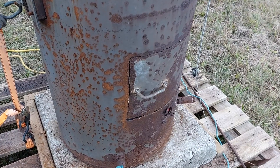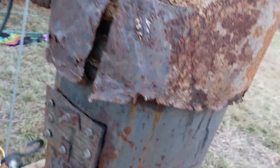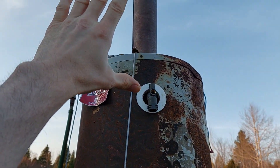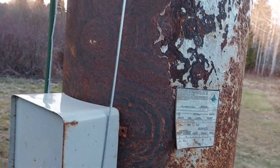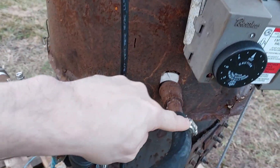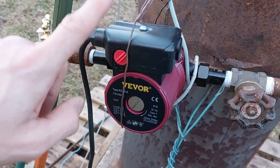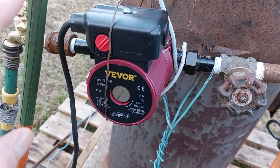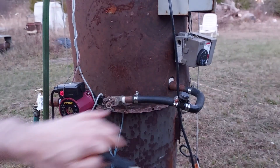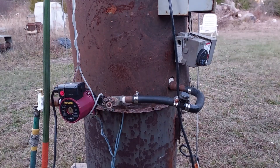What other functions can you have besides heating up water and circulating it? We'll get into that in a minute. First I'll show you how I'm circulating the water. Water — or water with some antifreeze — is in the tank, and I've only been using about 14 liters. The water comes out through here, goes into this circulation pump. This is a Vevör circulation pump — not a sponsored video — and it works really well. Just plug in the pump and it'll start circulating water from the tank through the heater core and back.